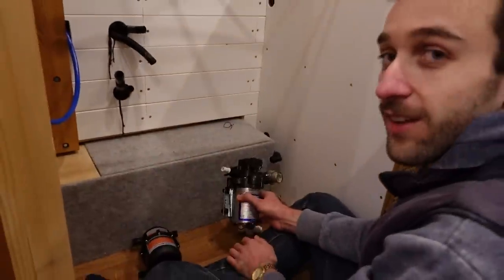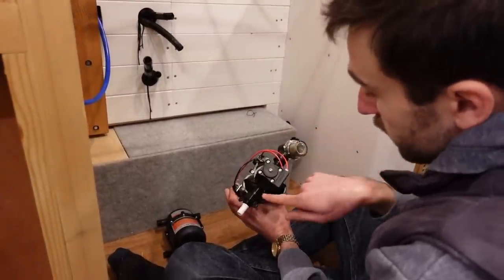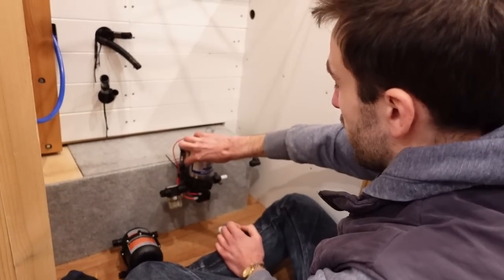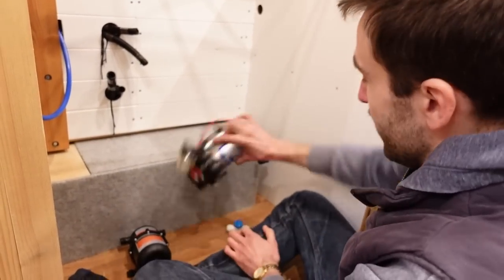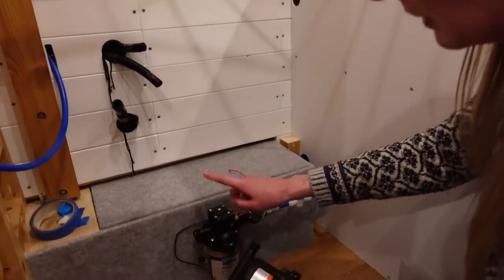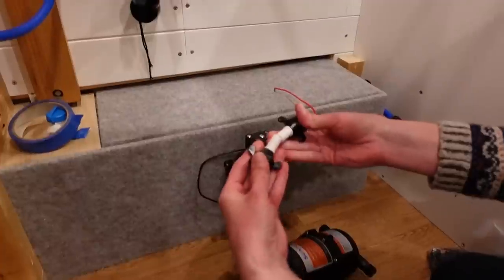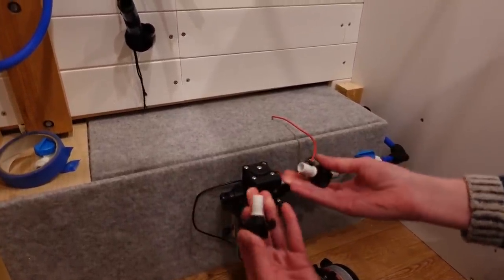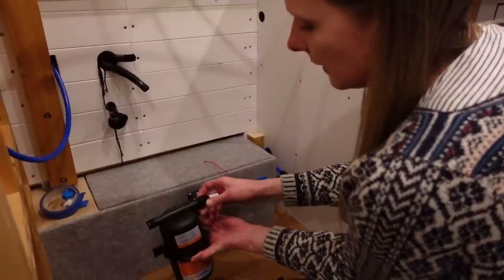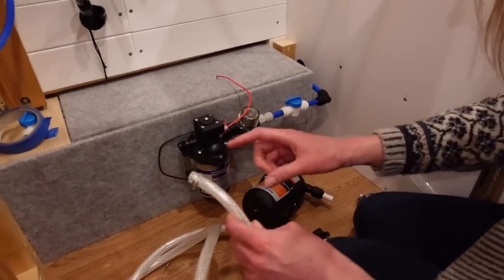To connect from the pump to the accumulator, you can buy a single joined piece, but the accumulator came with two fittings separately. So we're just going to use one on the end and then use some 17mm pipe with jubilee clips instead — saving about ten quid. The wingnut jubilee clips are quite handy because you can turn them without the whole thing moving around. The plastic connections on the accumulator say hand-tighten only with no PTFE tape.